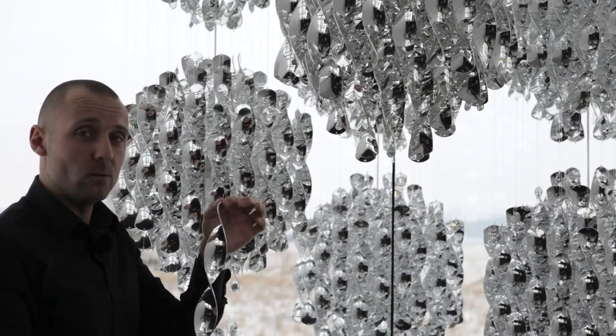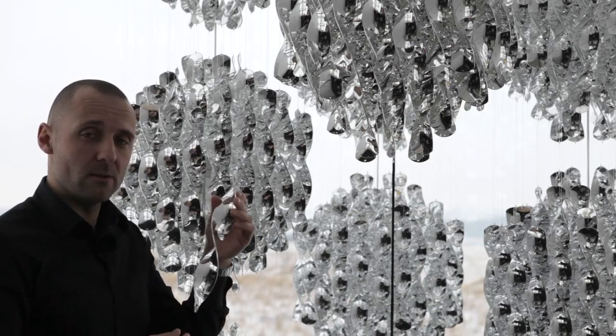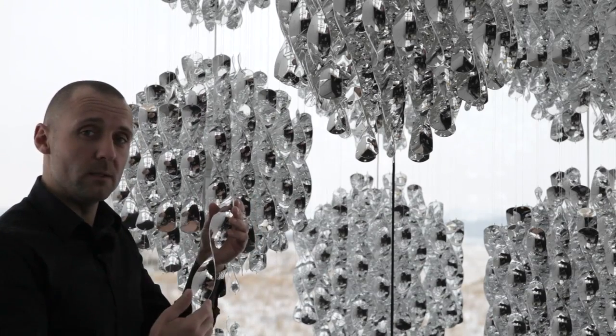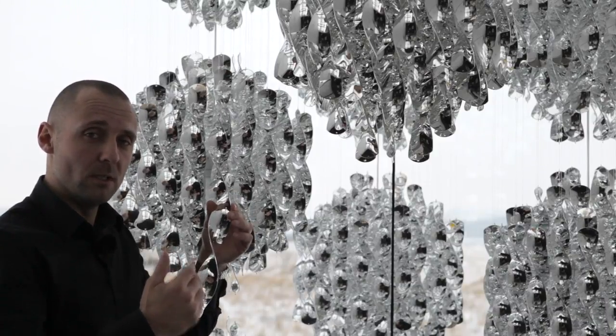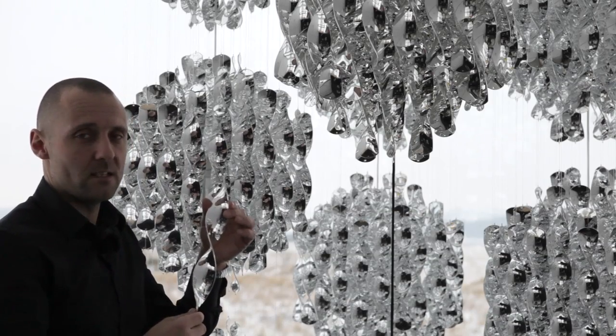The spiral, in general, comes in different price categories. The standard spiral coming out of the machine is white. Then we take the white spiral and we chrome it. The gold version is actually the chrome spiral that we gold coat. That's why the price level goes up for each surface we attach to the spirals.